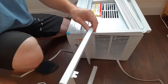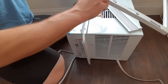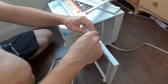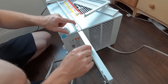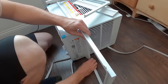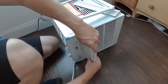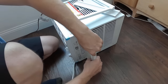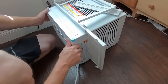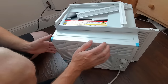You need to make sure you know which direction each panel goes. You want the upper lip to match the corresponding lip on the unit. Slide it through, and when it comes out you'll hear a snap — that means it's locked in place. Now it'll move back and forth as you extend it to fill up the window space.